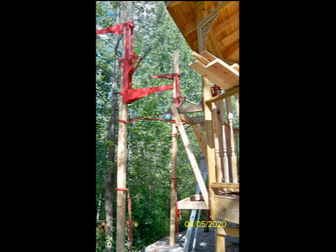With the framing complete, it was now time to do the roof decking and shingles. In order to do that, I'd need some scaffolding. I used 4 sets of pump jacks made by Qualcraft. I used 2 sets for each of the 8 roof sections. With the 4 sets, I was able to do 2 sections at a time.